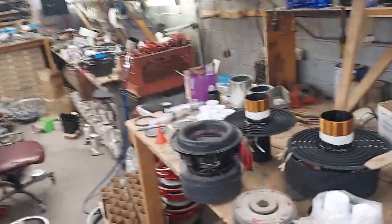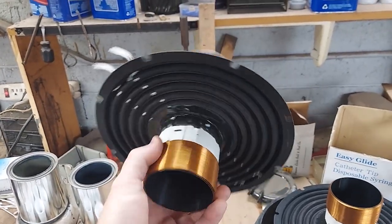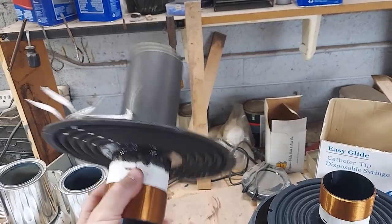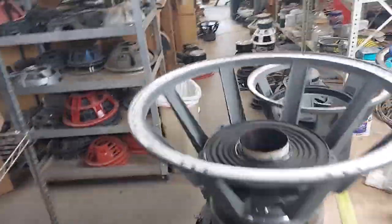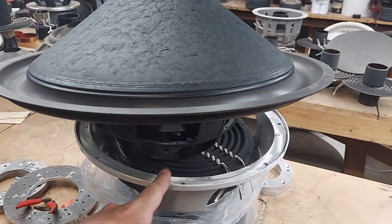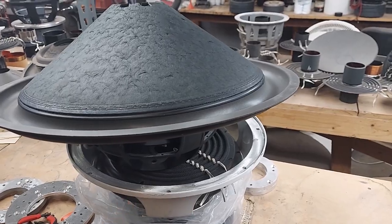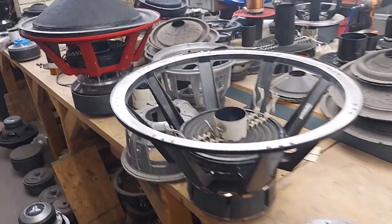These are Danny's coils on the TI frames — all cured and ready to go. I think we did single 2s because he's doing it on a Sound Cubed 4500, which is a bit heavy for two 12s, but they're not my woofers. And then I'm still going to build these out so they'll be available — these are 15-inch top assemblies for the Solo X small motor and they'll come with an adapter already on them so you just bolt them on and play. This is Herschel's — I gotta terminate these tonight and put the cone on.